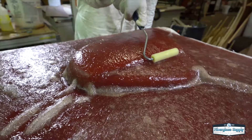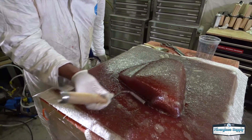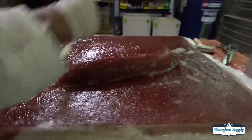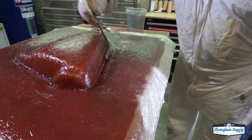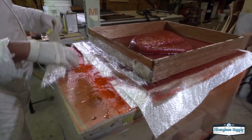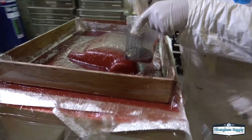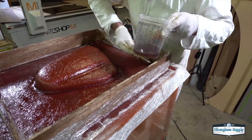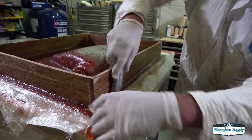At this stage he's going to apply two layers wet-on-wet. Tim likes to wet both layers out and then bubble roll them together; I prefer to wet one layer out, bubble roll it, then add the next layer and bubble roll again — but both are wet-on-wet. You can do two to three layers at a time that way. The reason you don't do more is that the resin will get too hot as it cures, causing the laminate to shrink, warp, pull away, and in bad cases develop bubbles. We've skipped ahead to the final layers where Tim is now putting the wood frame around the mold — it's simply there so the mold can sit flat on a table without rocking. A little chop mat bonds the frame to the mold.